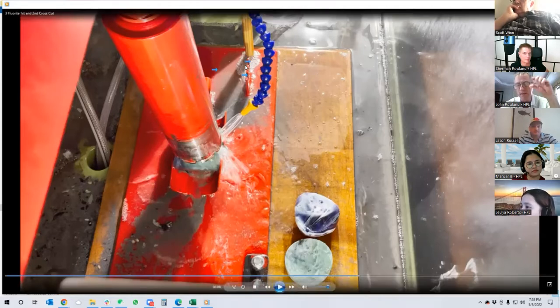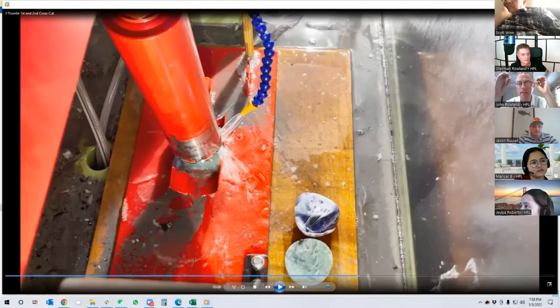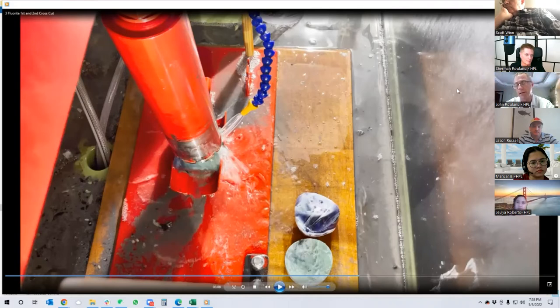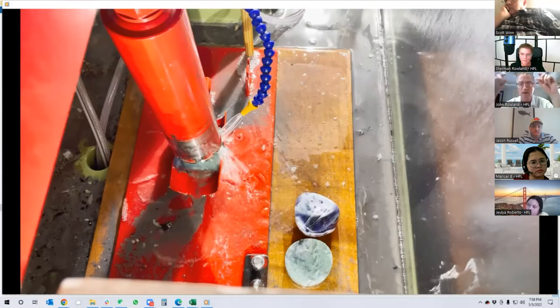And then what that does is it keeps you from having an offset, because offset's going to be a flat spot or a little groove on the side of your ball. You can eyeball it pretty well, but it's better if you use that pin, particularly if you're going to do 20 or 30 2.5-inch balls. You set them all up, you go, and then every single one is drilled exactly the same. Go ahead and you can continue, Sherm. All right.